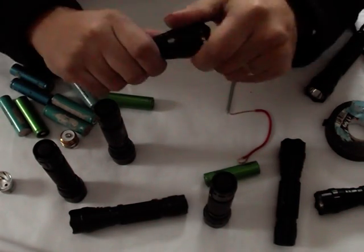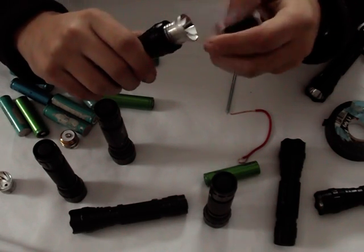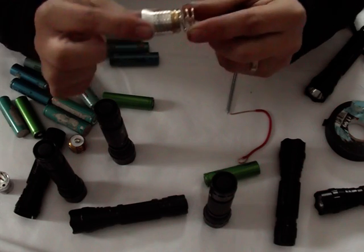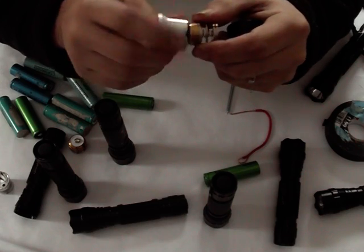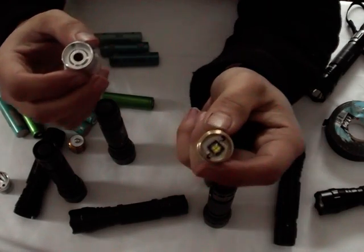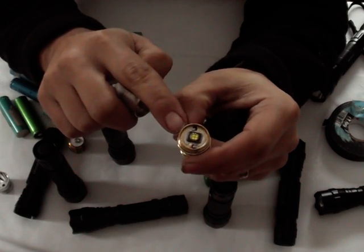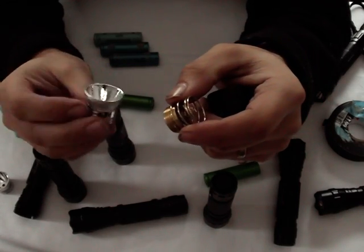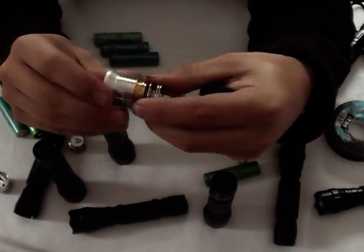If you do find that you've got a fault causing problems, nine times out of ten it won't be that the chip has failed or the driver has failed. There's a lot of things in here — in fact you can see this one's quite loose — that often need to be tightened up. The actual reflector unscrews and removes like that, and inside there you can see the chip — this one is a multi-core emitter Cree. Behind there is the driver for the chip and that's the LED on the top. This one has quite a wide reflector on it and these just screw on, and it's always useful to make sure that these are tight.